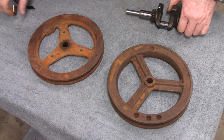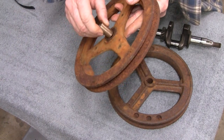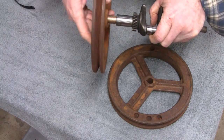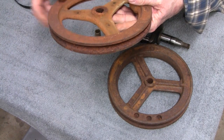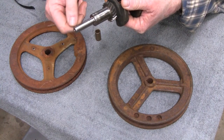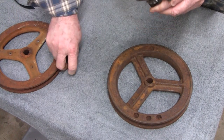Here's another problem I'm learning too. This one here has a 5/8" hole in it and the shaft is a half inch. If you put a bushing in there, that's no problem — it'll fit right around the shaft. So I was talking to Mike, and I said how about if I make a steel bushing and weld it in there, make the keyway and everything. And he came up with the idea of why not clad weld this and bring the shaft up to 5/8", and then we can cut a 3/16ths keyway in that. That's even a better idea — it eliminates a whole lot of future problems. So that's what I'm going to do.